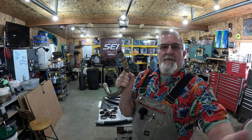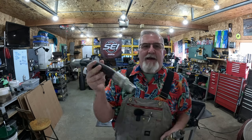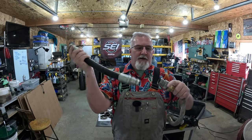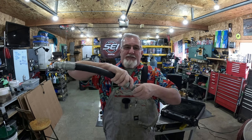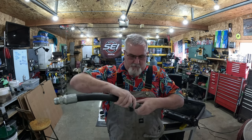So what he did for me by doing this is he made it so we can make a hose. So Napa can make this hose. They ordered me the JIC fittings for each end, a male on each end, because this one had a male on the outer end, male on this end. Now I have a serviceable part, barring any kind of catastrophic whatever's may happen.